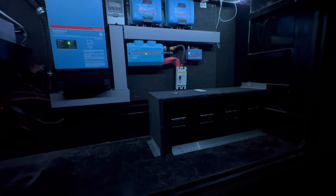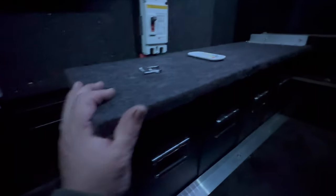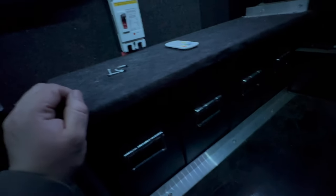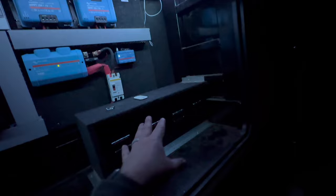This is what I did for the battery encasement: just some carpeted board over the top, pressing all the connections down. Got some angle aluminum keeping the batteries from moving, and it's solid — I feel like I'm moving the trailer trying to shake it. I screwed it down so you can set stuff on there. Plenty of usable storage space. That's 824 amp hours right there. Love these new batteries that come in different shapes and sizes. Got it all buttoned back up — that's how we ran our conduit through and up into there.